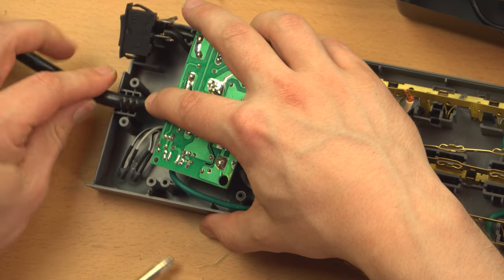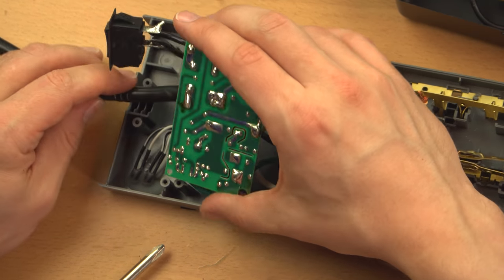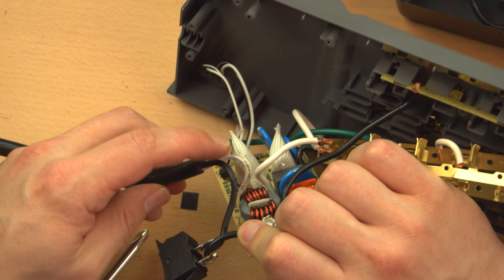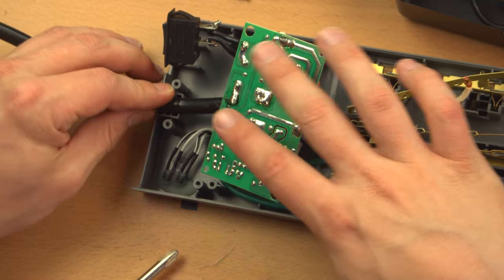This also looks like it has better cable strain relief, which is not something you really talk about too often, but if this cable were to loosen and we start pulling on connections in there, you could end up with a live conductor flopping around, shorting to neutral, shorting to other components. It might not be terribly good. It could result in intermittent connections and possibly fire.